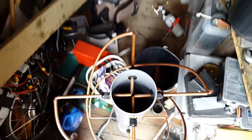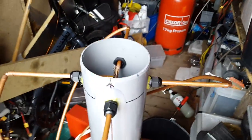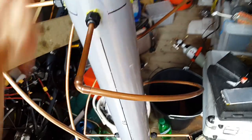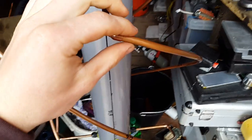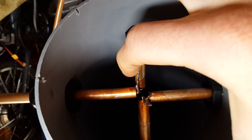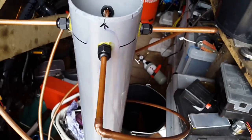I'm not totally sure if I've actually made it right or not — I'm sure I have. As long as it's twisted round to the left and it's exactly the correct height, it should hopefully be tuned to the correct frequency. If you get the height wrong, the frequency will be out. If the helices are a little bit not exactly uniform, I don't think that's going to matter too much, as long as you get the height right. The only thing I'm worried about is these touching inside here, but I'm sure I could move those around a little bit and just pull them out slightly, because I tried to make the length sticking out the same across all the glands so it's all even.